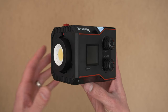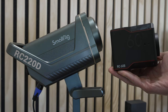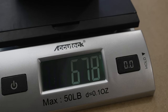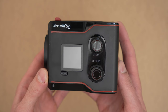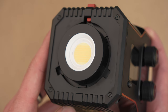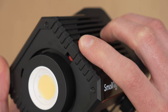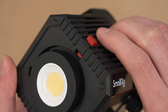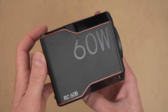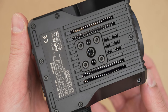This is very small for a COB LED light. I thought that my RC220D was small when I got it at first but this is much smaller. Weight is about a pound and a half or 678 grams. Construction is mostly plastic with bits of metal here and there. The LED unit is on the front, around which is a proprietary mini Bowens-type mount — but it's not actually a mini Bowens, it's SmallRig's own thing with a little release latch on the top. The top of the light has vents, a fan, and some heatsink. The bottom has more ventilation slots and a metal tripod mount.